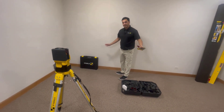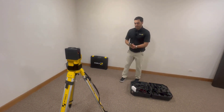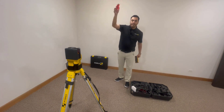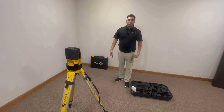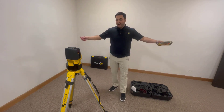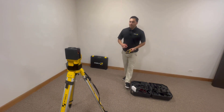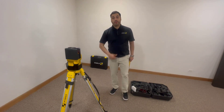What's unique about our laser as well is it's got that 360-degree vertical plane visibility. And with your reflector card, you can actually identify that line and go 360 degrees in various directions, adding versatility to transfer your lines. It's a great tool — one-man show, accurate, highly visible lines up to 65 feet. Beyond that, you've got your receiver that comes kitted with it, and you will be able to establish your square fast, quick, and easy with the 300-foot working range.